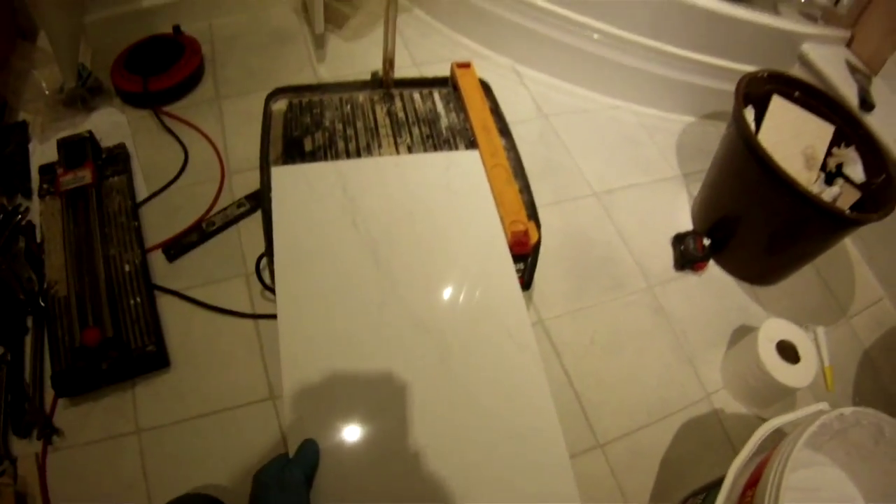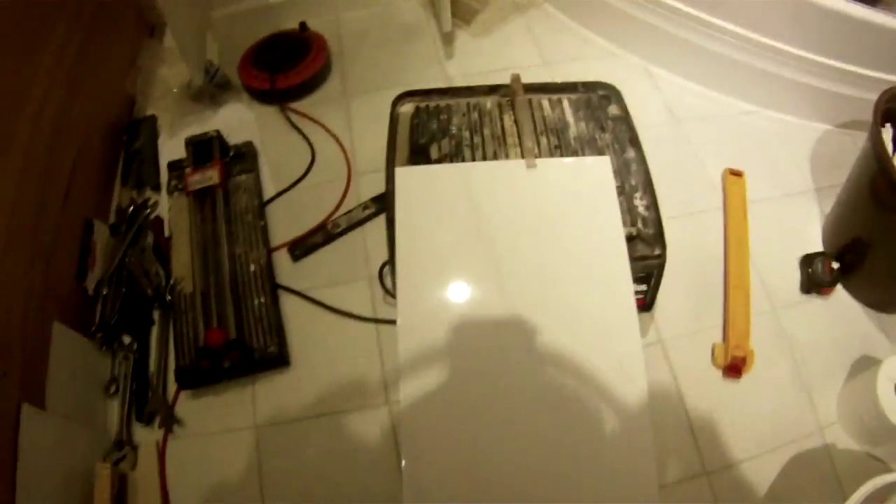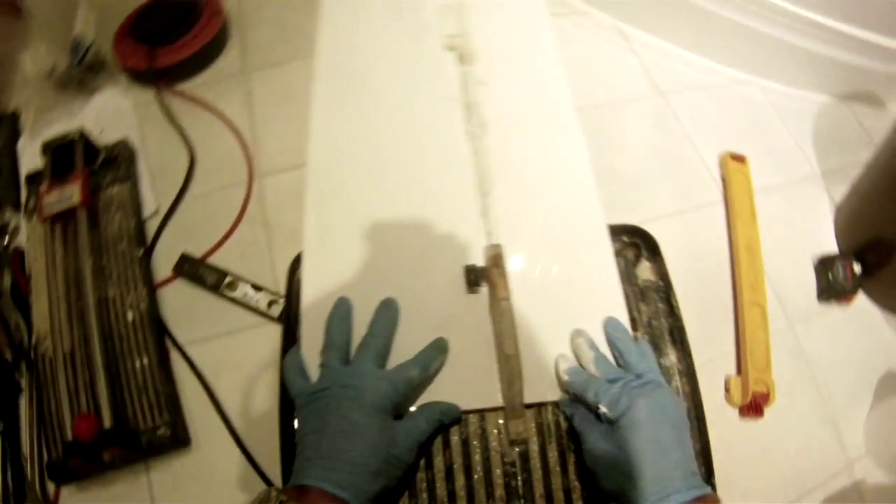We can slot that under the extraction vent — yes, that should be fine. For this long cut we've marked both sides by measuring from the roof down to the top tile, so we start off in the right position and just keep an eye on it as we go. So that's that tile and the shower refitted — the covers on the shower fittings cover up those rough holes we made, and we cut the slots and fitted the tiles around the extractor. That extractor is just a grill; the electrical part of the fan is 10 or 20 feet away because you don't have any electrical items near wet areas such as a shower.